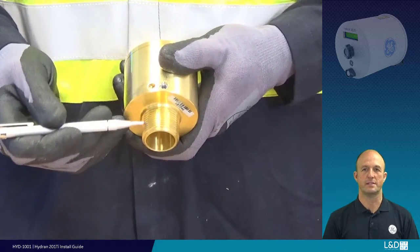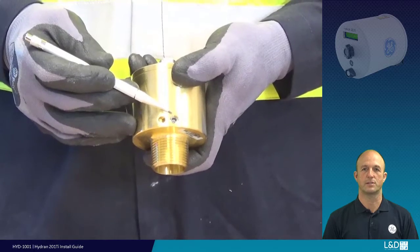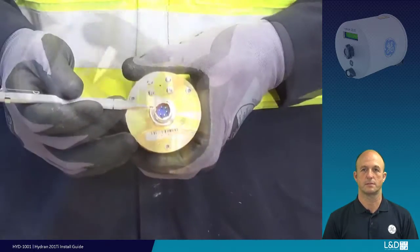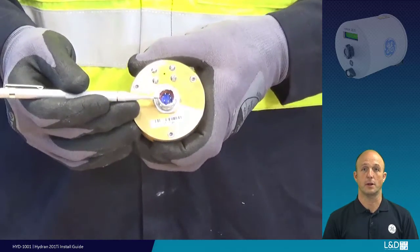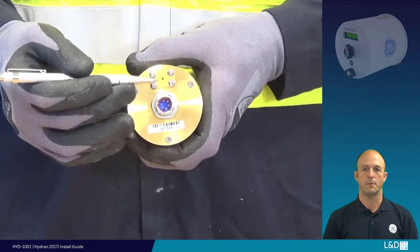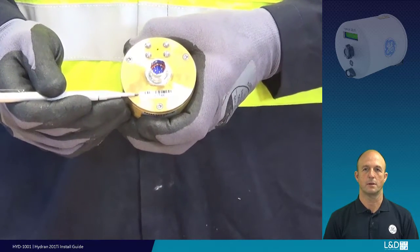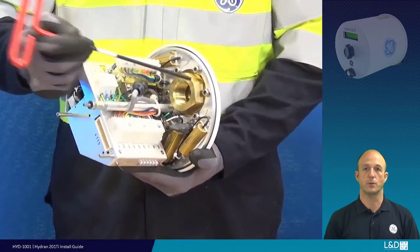Next, a closer look at the sensor. Here are the 1 inch MPT threads — check there is no damage prior to installation. These are the bleed port and bleed screw, to oil bleed the sensor during the installation process. This is the sensor electrical connection — it has a keyway to align the pins correctly. This is the sensor air vent — it must be kept clear to ensure correct sensor operation.